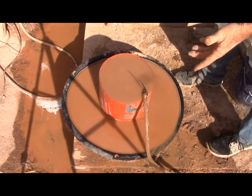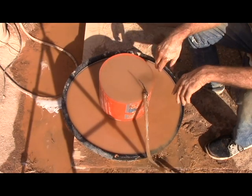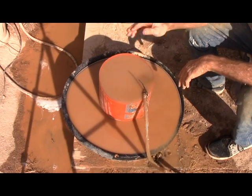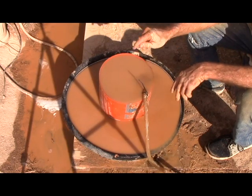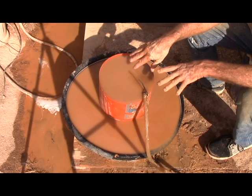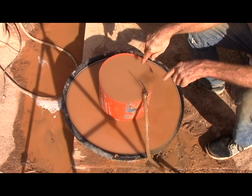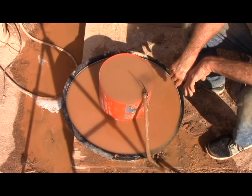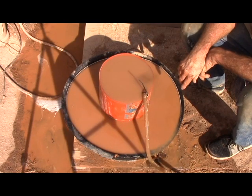Okay, so I put all the material through here. Should be in the neighborhood of 30 to 50 pounds of slimes. I'm going to let this run a little bit to kind of clear this up. Let it settle. I'm going to pan this material and then dry it. Whatever I catch from it, I'm going to put right back in it so that I can get a good assay. And I'll do the same thing with the finer material down from here and see what happens.